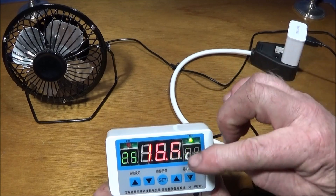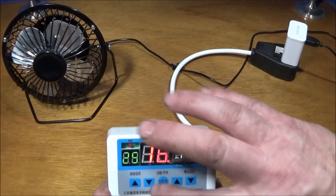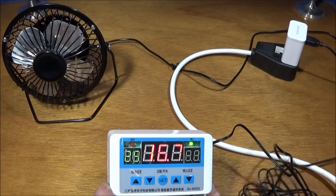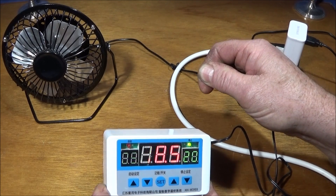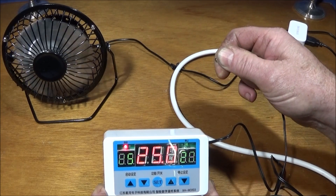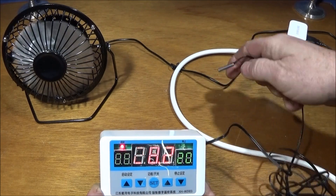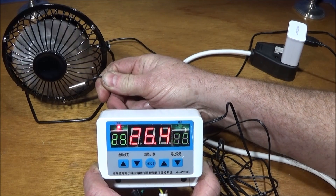This is the main mode — this is the temperature at which the unit will switch on. I've set it with the up and down arrows, it's all dead easy. This is the temperature it'll go off at — I've set it at 20 for now just as an example. You'll see that when I hold the actual sensor there the temperature starts going up. As soon as it gets to 25 the red light will display, the green light will go off, and the fan will start up. It's a lovely, positive unit with a really good switch in it, and obviously when it cools down it'll switch off.